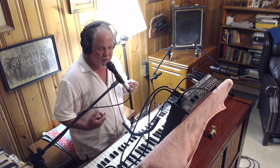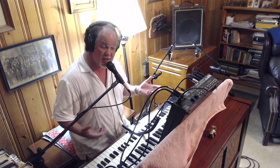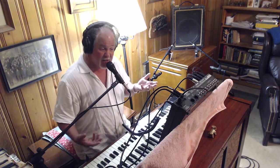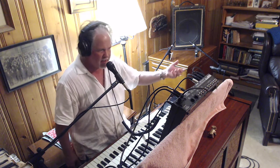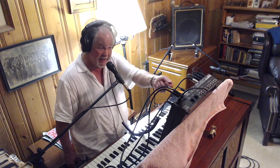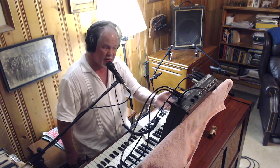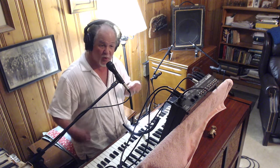Again, the cool thing that happened with getting the OBL-2 hooked up again, because the amp is clean now, is that the signal coming out of the direct line out is clean and free of hum, which it wasn't before. It had tons of hum in it, so I couldn't use it. So now it's clean. You got your mixer here, which I'm driving the audio interface with to make these videos. Well, just take the quarter-inch output of the OBL-2 and plug it into your mixer along with your Leslie, so you've got the direct line out, and you can mix that in with the signal from the Leslie, which is what some guys do also. They add a little direct tone generator mixed in. I've never done that before. So today was when all of this came together.